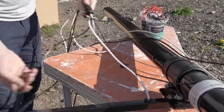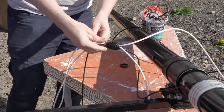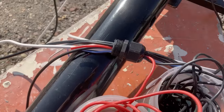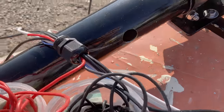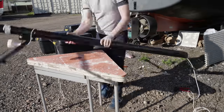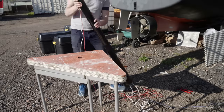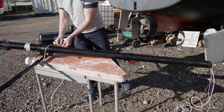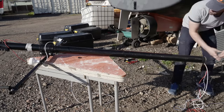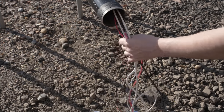The fiddly bit begins. Cables that get tangled, and some are more amenable than others to being fed through a narrow aperture and at an angle, but they all still fit. As a finishing touch, I'll use a blob of soft all-weather sealant to stop water gradually passing through the little gaps around the wires. Strictly, these glands are only for one cable, and the circular seal closes down around it. Luckily, the AIS cable was rather stiff, so it doubled as a sort of cable routing wire to allow me to pass the softer wires down the couple of meters to the mast's bottom, as they otherwise would have probably snagged and curled up halfway down.